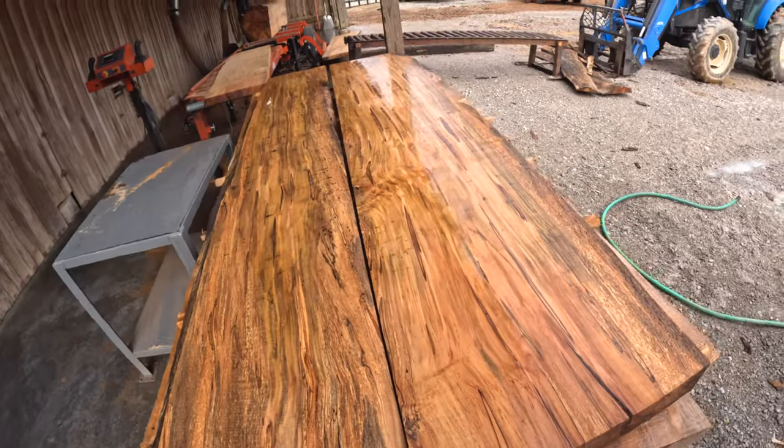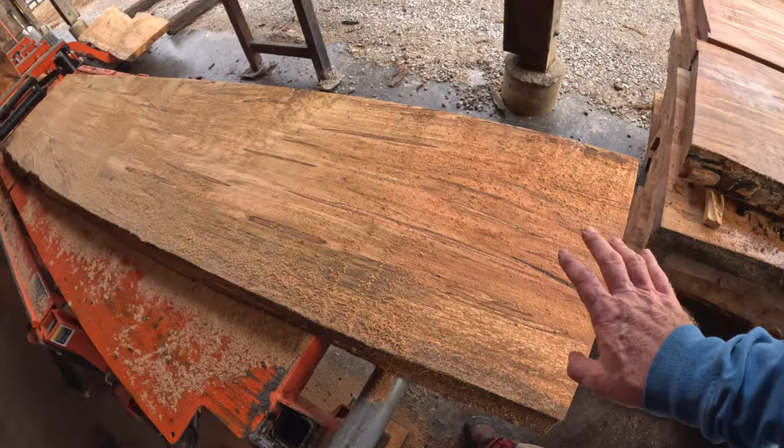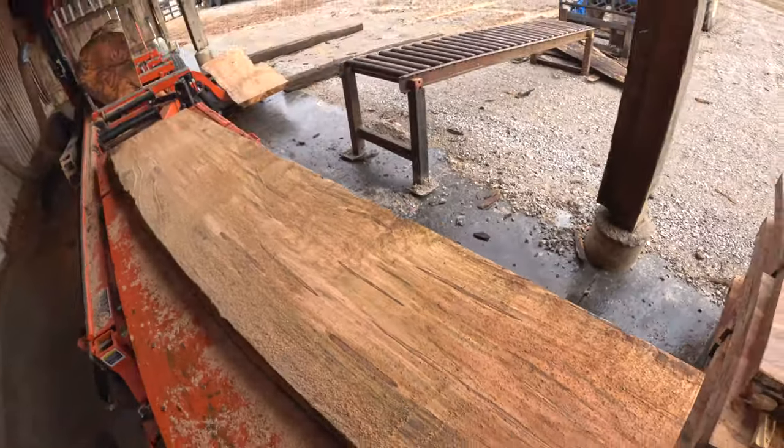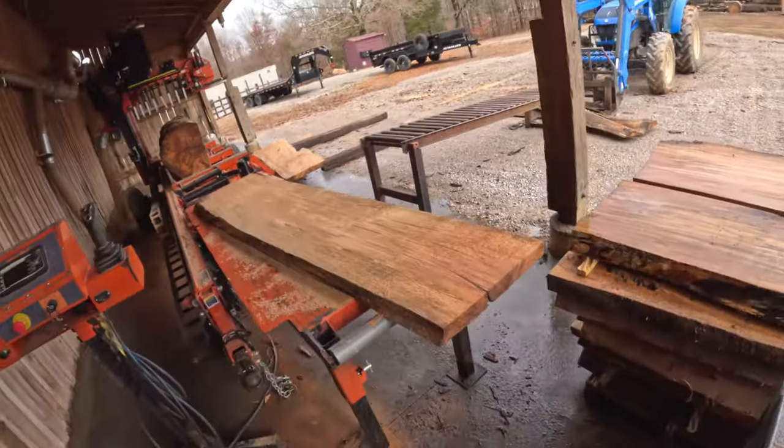Almost as pretty as me! About a 42-inch table that quick — your mill's set up right and if you're going at a good rate of speed, there's almost no sawdust. If you're packing sawdust, there's a problem.